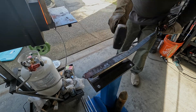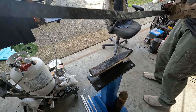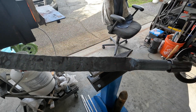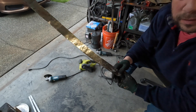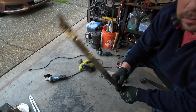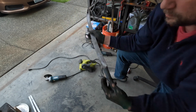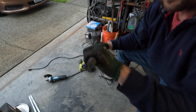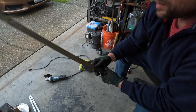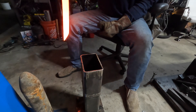I'm getting it refined and straightened out. I had to cut the last four to five inches off - you can see everything looks great and right on the end it just had problems. Here it is with that end trimmed and the area where the threads were folded in removed. Now I'm doing a rough grind to remove the scale, and then I'm going directly to heat treat.